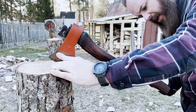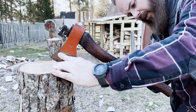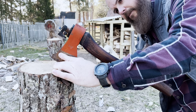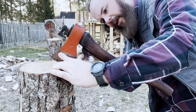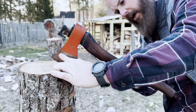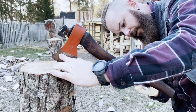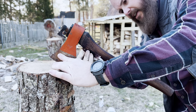And it will take the dark layer out, depending on how much, of course, you rub on it, and how much isopropyl alcohol, or fuel alcohol, I'm sorry, you put on it. Don't use isopropyl alcohol, guys. It's got too much water in it. Use the fuel alcohol, and you will get a lighter finish, okay?